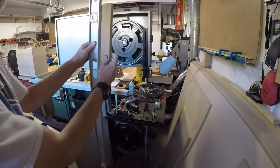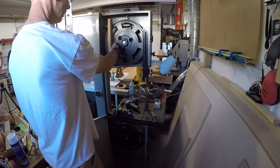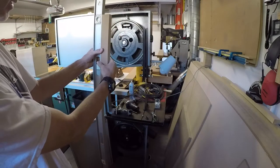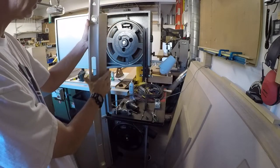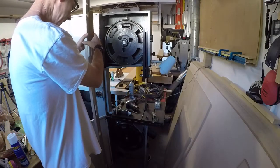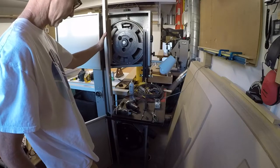So because I can't touch the wheels, I'm actually going to just temporarily affix these blocks to the straight edge. So I just ripped these. And these guys are going to go right here, right on that wheel. And this is going to be secured with some 2P10 quick set glue. And I'm just going to put it on there temporarily. That stuff can break off, so I'm not worried about it sticking. And so basically, it'll be like that.